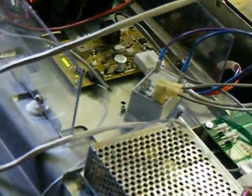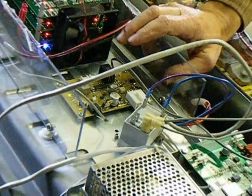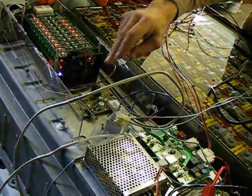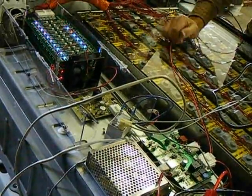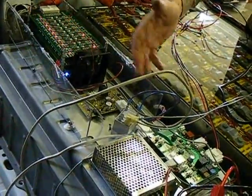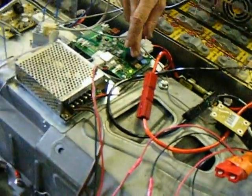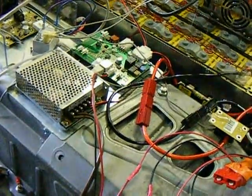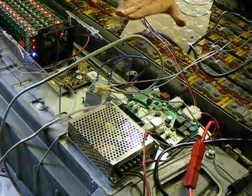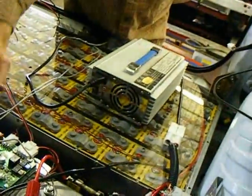This is the supervisor board for the battery management system. It's made by Ewart Energy, and we have this ascending array of green LEDs indicating that the pack is charging. All green LEDs is a good thing. And here's the rear can board, also in charge mode. This relay here controls the charger so that when the pack is full, the BMS board will turn off the charger.